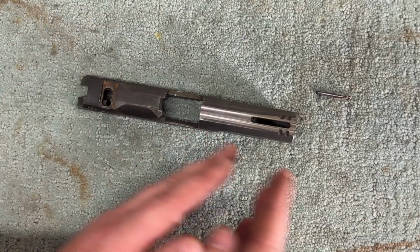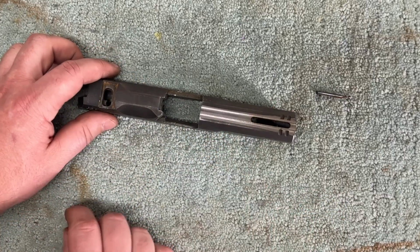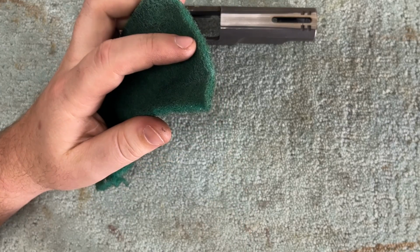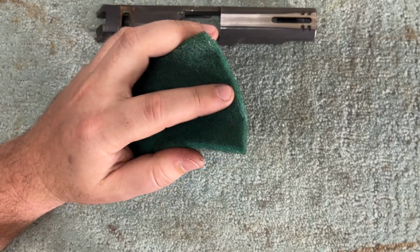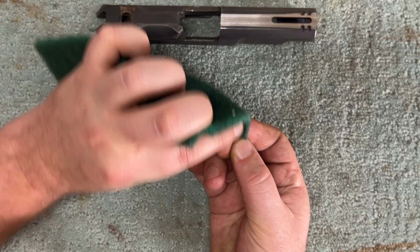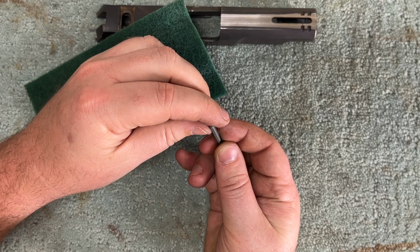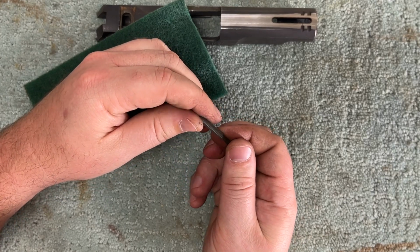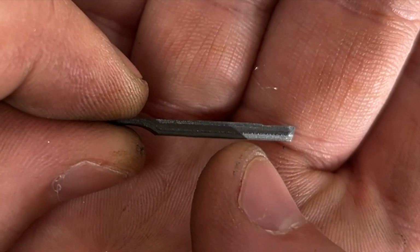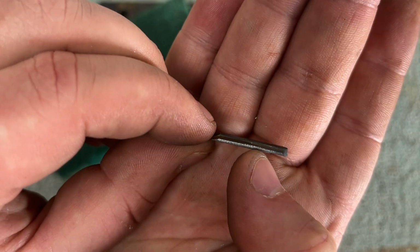And that's especially going to be helpful on, say, the barrel, which it's much less likely that someone's going to Cerakote when they're done than, say, the slide. We can take steel wool and address the problem that way. Now, I'm a much larger fan of real steel wool over this synthetic stuff, but this was what I had at hand. And you can see it cleans up pretty dang quick, at least that halo of color. Now we do still have a slight difference of top, middle, and bottom. You see that? It's a slight difference, but we did get rid of that little brown.